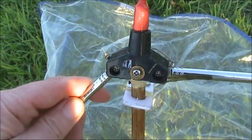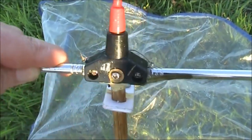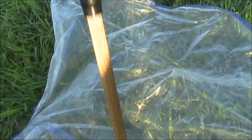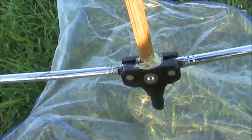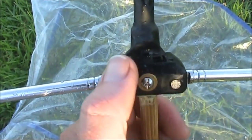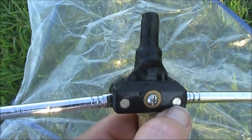The main ingredients of the beam are two sets of telescopic rabbit ears TV antennas — one for the driven element and one for the reflector. The one for the reflector has both halves connected together; you may just be able to see the wire connecting them under the heat shrink.